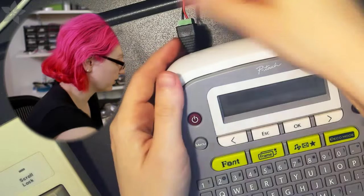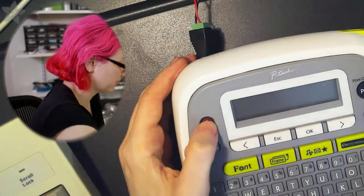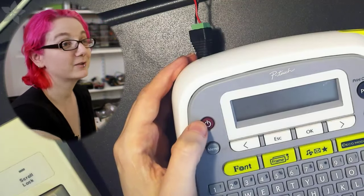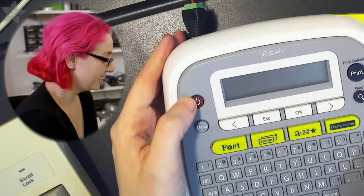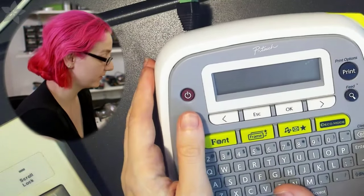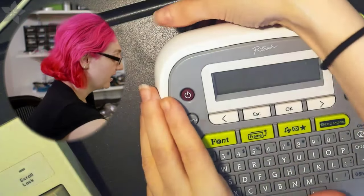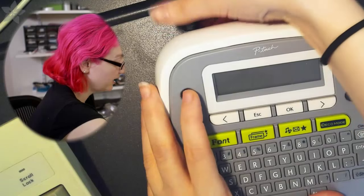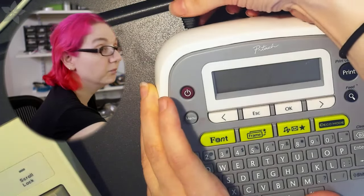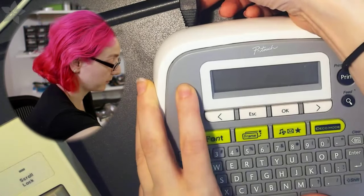It wasn't working before. Hold on. I wonder if I accidentally fixed this. Okay, now it's not working. Good. Sorry, it's flaky. It does work once in a while when you plug it in, but it doesn't always work. And that's probably why it was set aside, because first off, the batteries were corroded, so it wasn't running off batteries. And then depending how you plug it in, it turns on this time, but then if you move the DC jack even a little bit, it stops working.